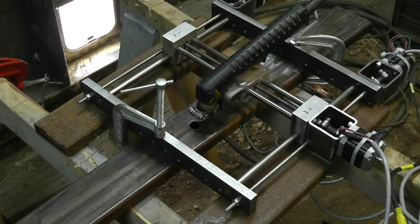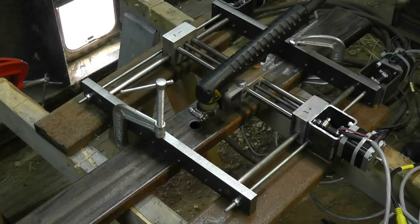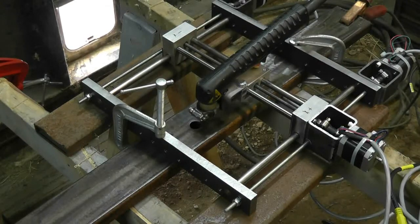Okay guys, so we're all ready to go here. Plasma cutter's on, we've got all the green lights on it. We don't have a ground — hang on a sec — there we go. So we're grounded to the piece of tubing that I want to cut. This is going to cut a small circle. It's not ideally set up — this is just a G-code program that draws a circle and I just added a spindle on and spindle off at the end, which is what I'm using to turn the plasma on and off.